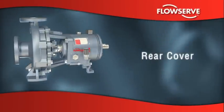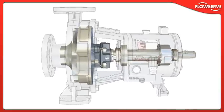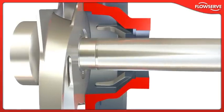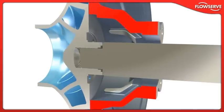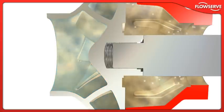Rear cover. Besides serving as the critical running clearance and wear surface, the rear cover also houses the mechanical seal chamber. It is here that FlowServe innovation is focused on reducing the chance of mechanical seal failure, recognized throughout the industry as the number one contributor to pump failure and process downtime. The standard Durco Mark III ISO pump incorporates the award-winning Durco SealSentry seal chamber, which features an oversized, tapered bore with flow modifiers. This innovative design maximizes mechanical seal life by creating an environment free of erosive solids. SealSentry flow modifiers redirect flow from circumferential to axial, minimizing erosive wear near the seal faces and providing a constant flush which reduces heat build-up. And because the seal chamber is tapered, vapor bubbles cannot form near the seal faces, preventing heat checking and premature failure.